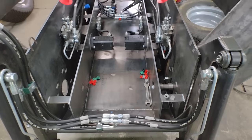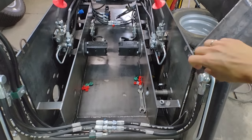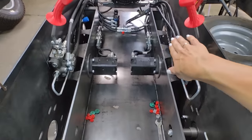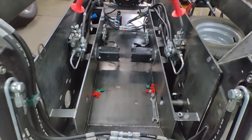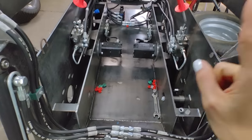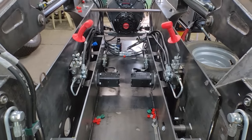Alright friends, the hydraulic system is pre-assembled, but all the nuts here are tightened only by hand. There are no sealing rings and the high pressure hoses are not fixed, because initially it was necessary to find out how they would run, and besides I haven't connected the drainage line yet. However, first I need to test the engine and it requires some preparations.